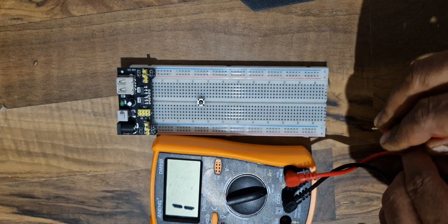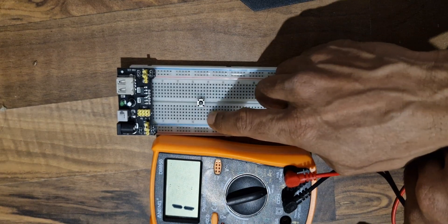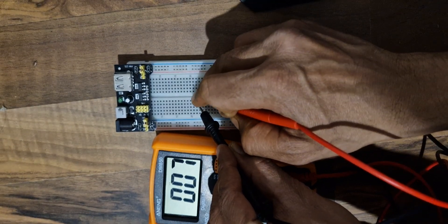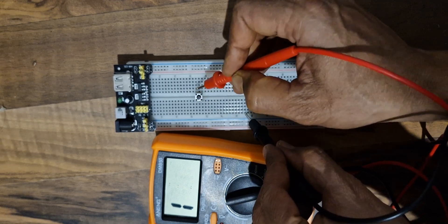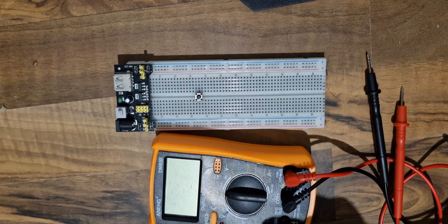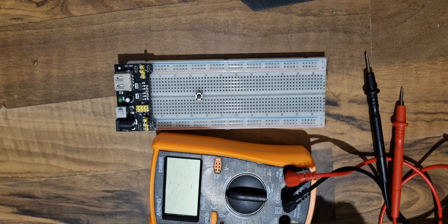This is how you can test the switch. I hope you found this module useful — you understood how the switch works and how we can actually test it. These two pins and these two pins are not connected to each other, but when you press you have a connection. Similarly these two are not connected, but when you press these two will make the connection. Hope you found this module useful. Share it with others for wider reach and stay tuned for more engaging content. Till then, wish you happy learning. This is the test of short circuit and open circuit.